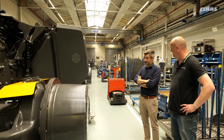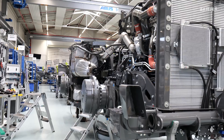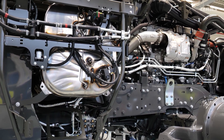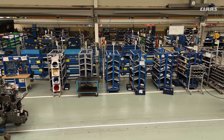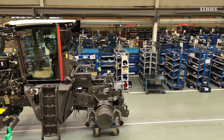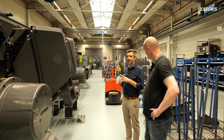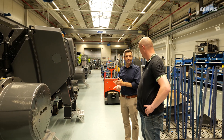On the Xerion 12 series, the pump transfer gearbox has two tasks: first, we speed up the engine output to feed a higher RPM into the gearbox; second, it is a pump drive. For heavy hydraulic applications, we can go up to three independent hydraulic pumps and supply more than 536 liters per minute of hydraulic oil. That said, there are not many implements on the market that actually require more than 500 liters per minute.